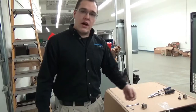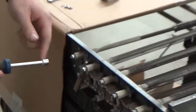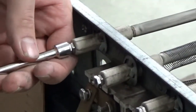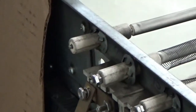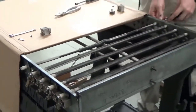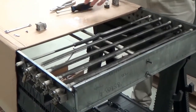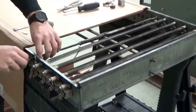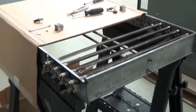Now we can start removing the rod itself that holds the resistor in place. We're going to take our 5/16 nut driver and remove both nuts on the double-nutted rod. You may have to do it just one at a time. In some cases it'll be easiest to have two people — one person holding the rod on the opposite side of the tray, one person on this side un-nutting the rod. We're going to take the nuts off the opposite side of the rod, remove the porcelain locks, and from here we can pull the whole resistor out. Here we have it — removing our bad resistor.